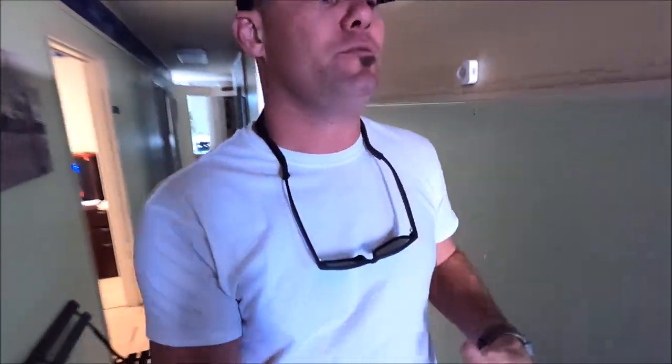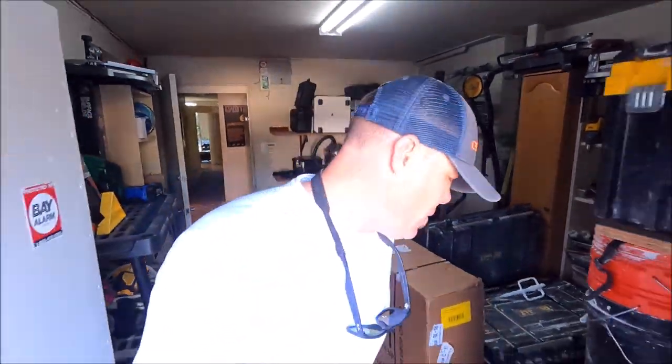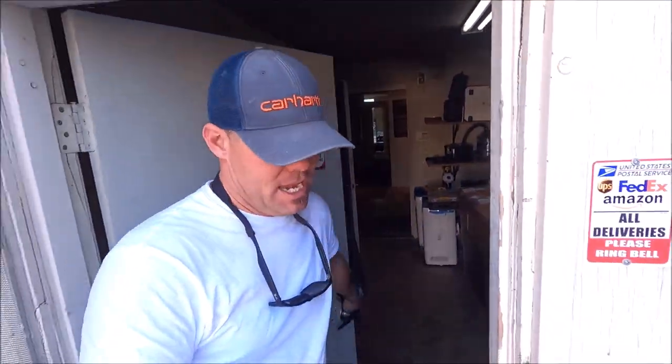All right, guys, let's get the show on the road. This shower is nearly complete. All we have left to do is finalize the niche, trim it out with Schluter Jolly, install some beautiful glass mosaic behind it, and address the gaps on the left and right side of this shower. We'll show you how to do that, and of course, we will install the trim kit, shower head, polish, seal, and show you what the final product looks like.